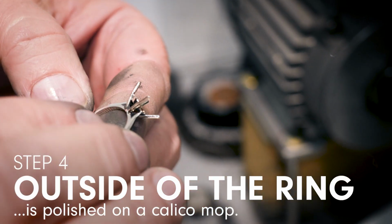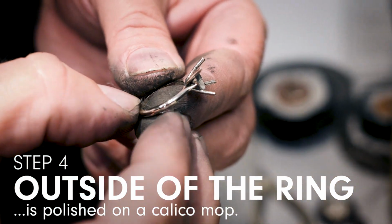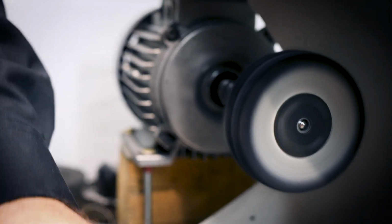Step 4 is we now switch to a calico mop, which is made out of canvas. This will get into all the small gaps and nicks and places that the felt mop couldn't.